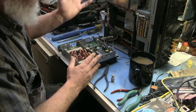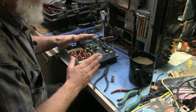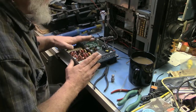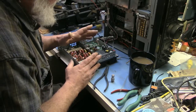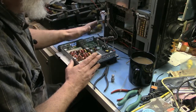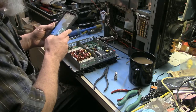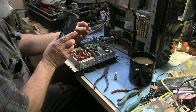If there's any little bit of signal there, an unterminated output can turn that into a severe parasitic self-oscillation, and it could be catastrophic. So you always want something on the output. There are bypass caps and the like that do tend to suck up some of the real high frequency stuff, but nevertheless, like I said earlier, we're going to have a dummy load on the output. Now for the input, for the dummy load and the input, we have these little, I'll just show you here. We have these little plugs.